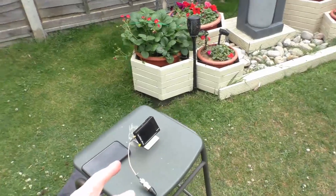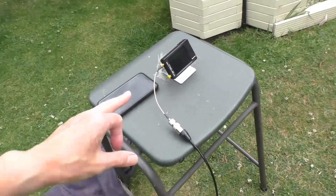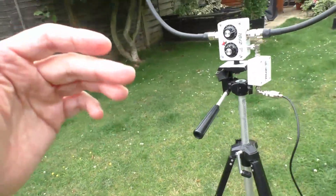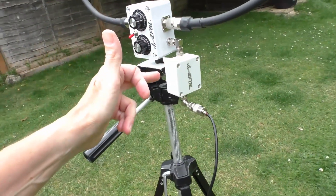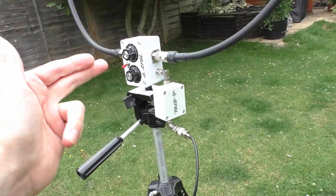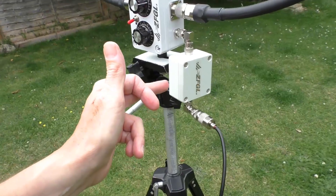At the moment it's very difficult to film this in daylight — I'm going to have to use that fleece over the camera. I've got a little pigtail on there going to the magnetic loop. The first couple of things I've learned straight away is that you do need this little balun in place. When I took the balun away, the antenna was tuning between 400 and 500 megahertz, which puts it up into the 446 band. For HF work, it appears you do need that balun in place.